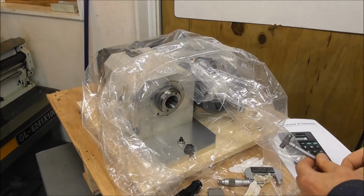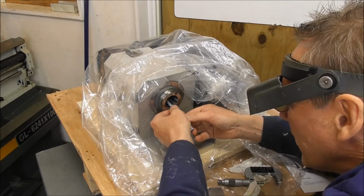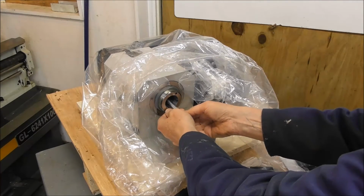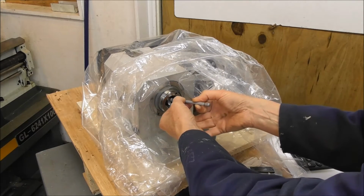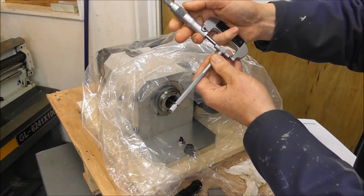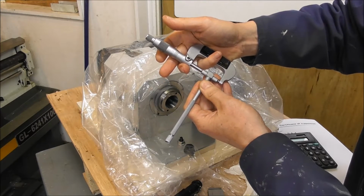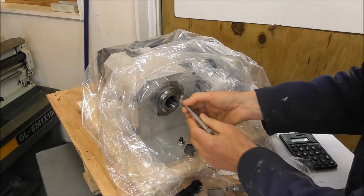Well, just going over using a telescopic gauge, it's a pretty tricky process to set it really correctly. If you open the gauge inside the bore on the maximum angle and tighten it up a medium amount and move it very slowly off center with just one pass, you'll still have a little bit of compression on the telescopic gauge, and you'll get a measurement that is slightly big. I know this from many years of experience of making fits. Yes, and it's 31.765.